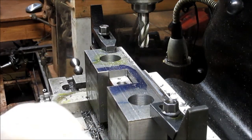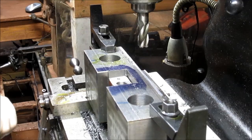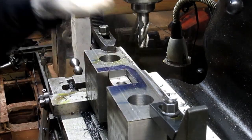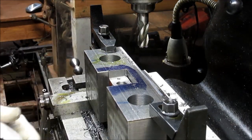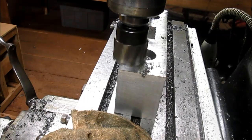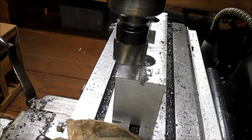Since we're here — we're level, we're flat, we're square with the two holes — I think it's probably a good idea to just go ahead and take our finishing cut. The way we're going to have to do that: I was hoping to throw a nut down here, but that'll mess up the cut. So I'm going to machine a couple of washers that are just going to slide down into that hole, then tighten up some bolts and T-nuts to hold everything in place while we open up this top area so we can mill it. Let's go find some washers. We're going to take our last surface cut across the top of this and then install it — at least temporarily — to see how it works and make sure everything is in good shape.